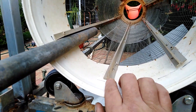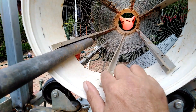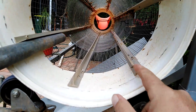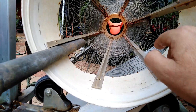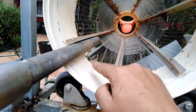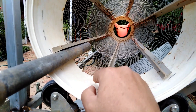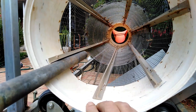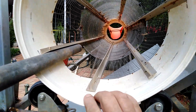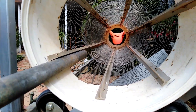I've used T-aluminium for the inside for two reasons: one, it gives rigid strength right through the whole unit; and two, it picks up the stone and throws it, so as it's going around it's not just going to sit in the bottom and roll — it actually gets picked up, thrown to the other side, and that breaks the dirt off the stones. The better you sort the stone from the dirt, the better off you are.